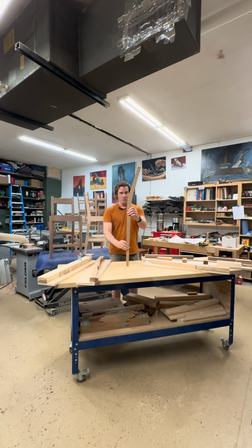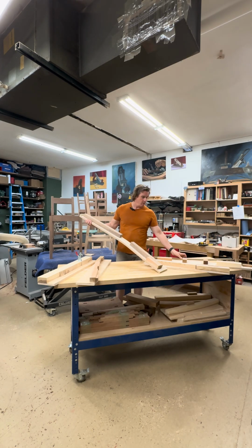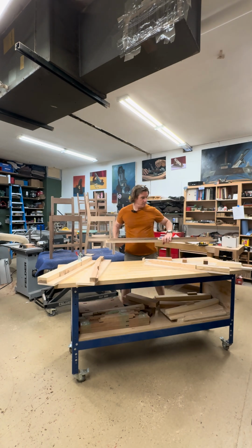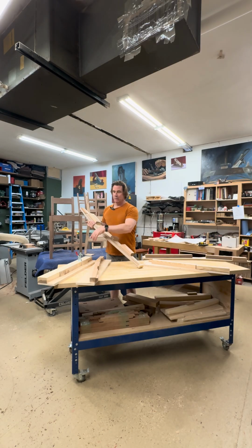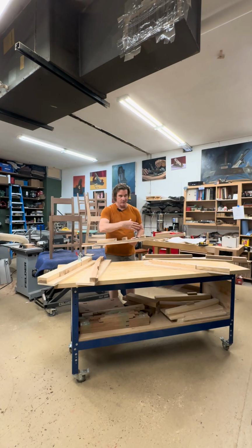Now, this is the back leg. Okay, it sits basically like this. And what I do is I cut it out of the stock, and then I had to make this gizmo right here. So this took some time, right? And this flush cuts the inside face. I mean, yeah, the back face right here. That's what this one does. This one right here does the exact opposite. Okay? And these pads are for the hold downs, right? So I don't have 100 of these things, so I'm always unscrewing them and putting them back on to do the thing that I need to do. So it took a little while to figure out the process, which face I cut first, and then what I did secondly, and all that other stuff.